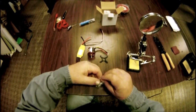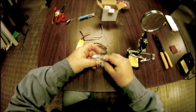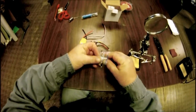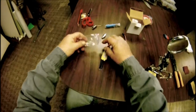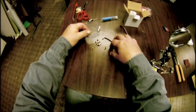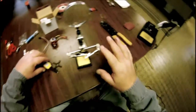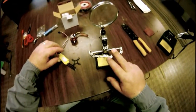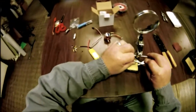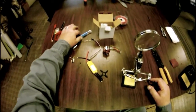Now you will have to solder on all your bullet connectors, so I'm going to do that now and show you how easy that is. I've got a Radio Shack 40 watt soldering iron and a little helper hands — I like this thing, it's a lot easier. And I use a 60-40 flux core solder.